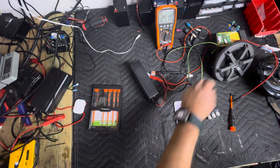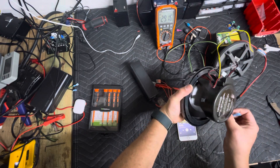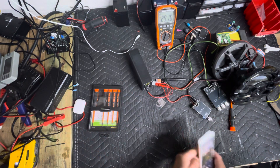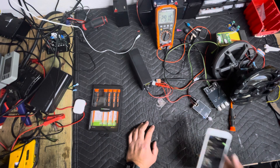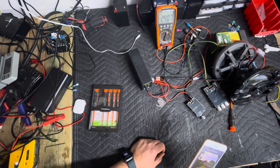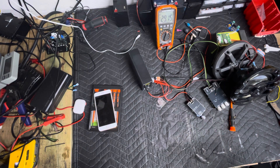Let's test a 1001B on the same battery. That sparked — always nice to have that big spark. Let's go ahead and plug this one in. This one should play, but it might not sound very good. I haven't used a 1001B amplifier in quite some time in a build with the Talent Cell. We're at 29.16 volts. Let's connect the Bluetooth — okay, that's a good sign, we heard it that time. And it works fine. So that was one of the things that happened in initial testing too — the 1002T couldn't take it, but the 1001B was usually fine.